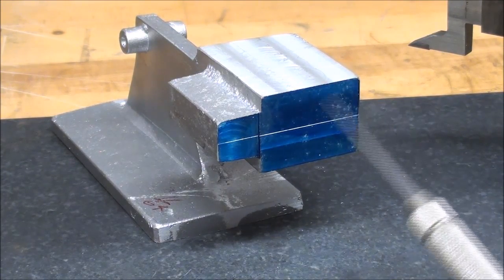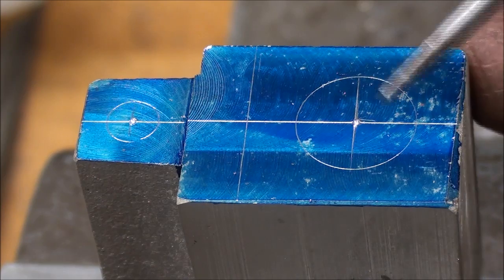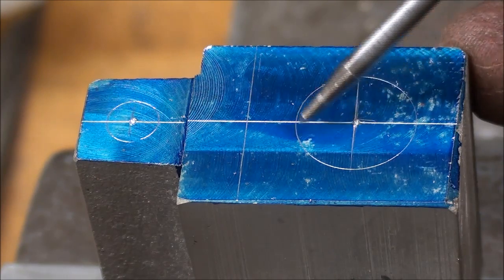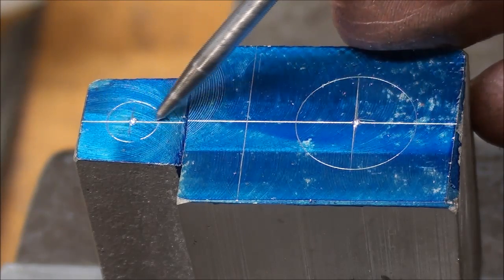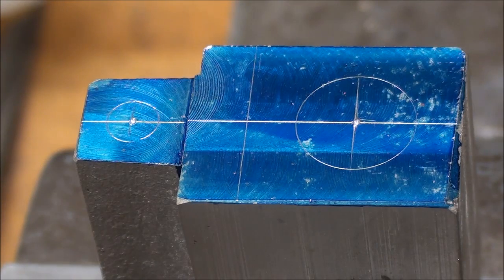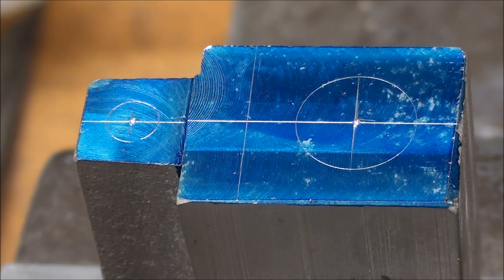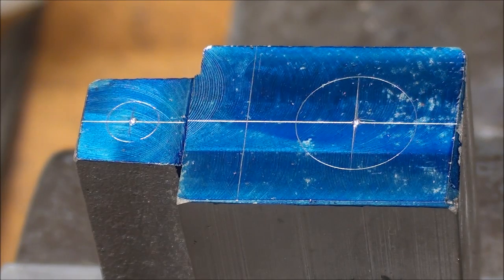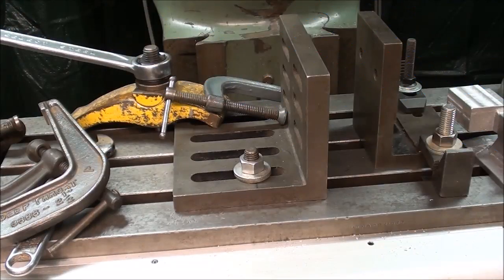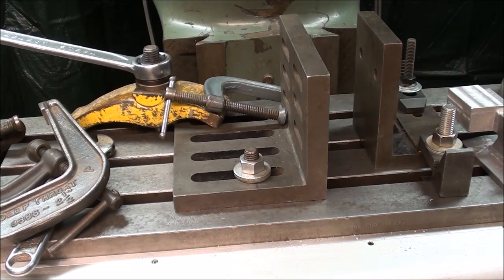Now I need to locate them in the other direction. Here's what the layout looks like. I only put the circles on there for your benefit — they aren't necessary — but that's the 9/16 bore and the quarter-inch hole for the valve, drawn along the center line. All this location could be done on a milling machine with a digital readout without any need for layout at all, but I'm going to do it the layout method here just for variety. So it's ready to go over to the milling machine. There are times when a setup takes much longer than the actual machining operation, and this certainly has been one of them.